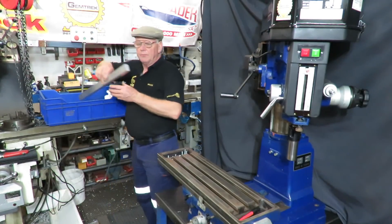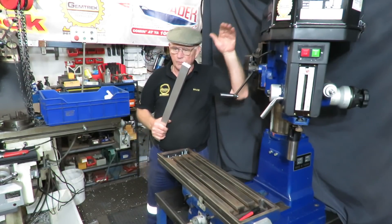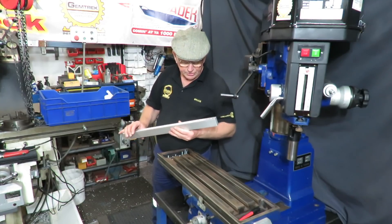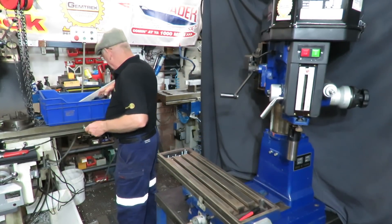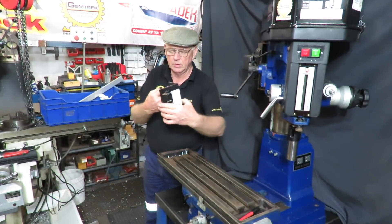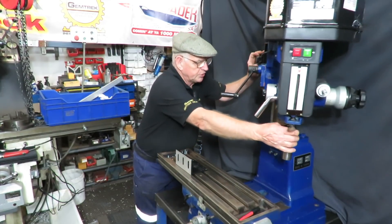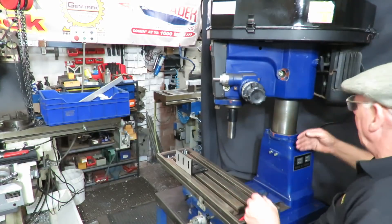The other component is a beam. The length of the beam is determined by the amount of movement in the head for the vertical rise and fall - that's a true beam, aluminium 6061, and it has three threads in it. The final component is this bracket. The bracket is made with slots in both planes and that allows you to adjust it to the many different styles and types, and mainly to take into account clearance.